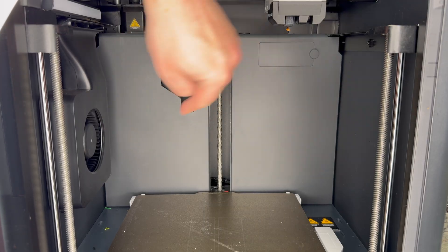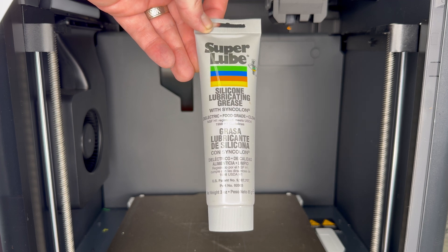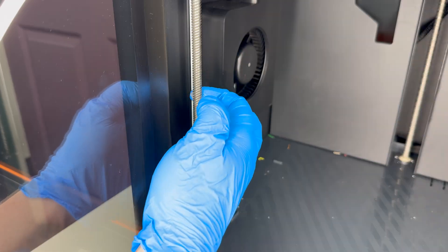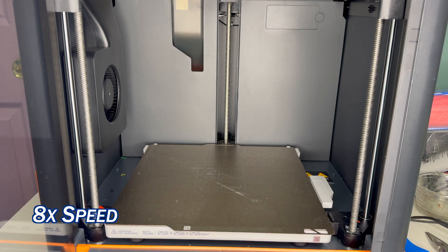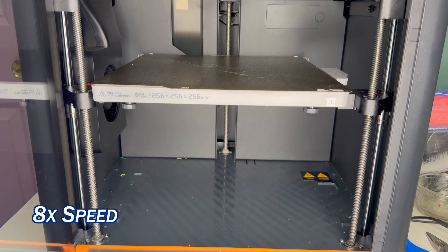The x-axis rods may not need greasing, but the z-axis screws certainly do. You'll want to do this every three months or so. You'll need a lint-free cloth and some SuperLube 92003 Silicone Lubricating Grease with PTFE — link to that on Amazon in the description. The first step is to get any dust or debris off of the three lead screws using your lint-free cloth. With the screws cleaned, you want to home the printer. Now that it's homed, you'll spread some of the silicone lube all the way around a spot on each screw. Then you need to lower the bed all the way, and then home it again to really spread it all around. You can do this movement procedure a few times to really make sure it gets all over.